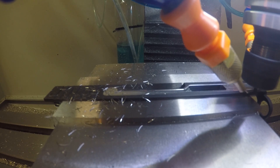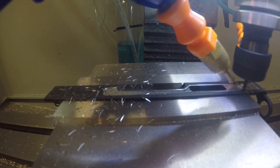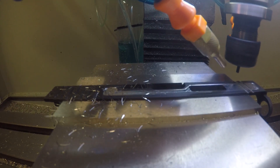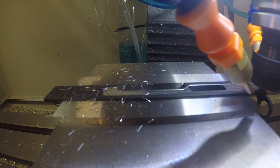I'm definitely going to continue using this approach. In the past I was doing these serrations with a 1/16" end mill, and you can imagine how long it took to rough out that pocket. It really wasn't worth it, and 1/16" end mills are pretty fragile, so I'll avoid using those if I don't have to.